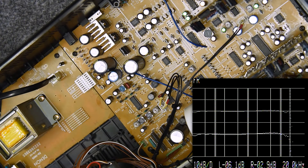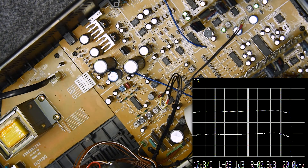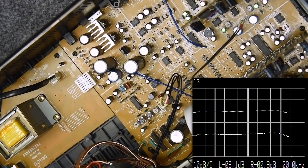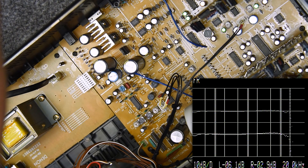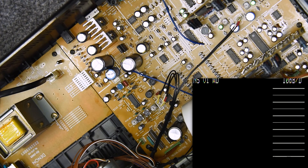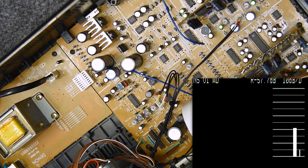The left channel is a little bit short. I found that at different parts of this tape — flipping back and forth, flipping directions, changing different sections — I could hit that left channel with no problem at certain points. So I have to take all these things into account when setting the bias and optimizing it. I don't want it to reach a certain point in the tape where it's just totally distorting, but I want to balance it out so the whole tape sounds good. And that's the reason I'm going through all this.